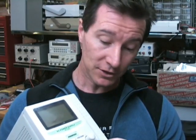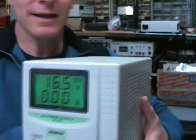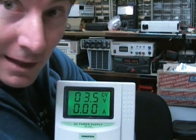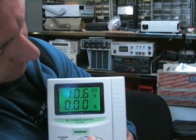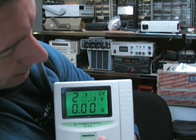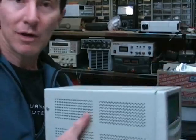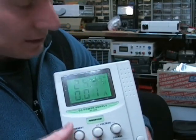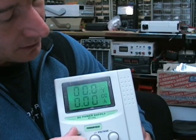Let's just switch it on and see what the display looks like. It's really a sexy looking display — I really like it. If we turn up the voltage, let's see where the relays kick in. It kicked in at about six odd volts, so that's the first tap on the transformer. Then at about 14, and then at 19 to 20 volts, it kicks in another tap. They do that just to reduce the power in the series pass transistor — they don't want to waste excess heat, so they just choose a different transformer tap. It switches between constant voltage mode and constant current mode, and it tells you which mode it's in — that's actually quite nice.